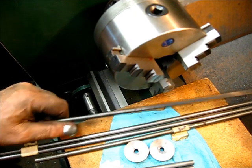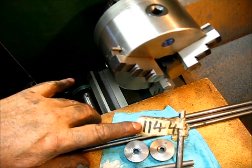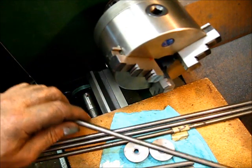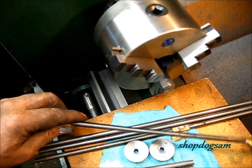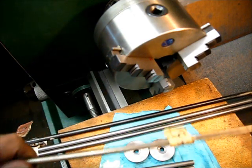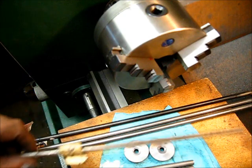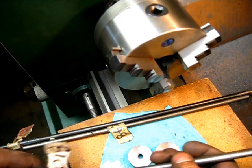Valve stem material — I'm rummaging in the box over there. I have used this right here with great success. It's 1144 steel. That's some good stuff right there — tougher than nails. 1144, that is a good choice for a valve stem. I've got enough there for two. I also located this piece of 8620 in the box over there — that's enough for a couple. I'll use that up as remnants of a past project.